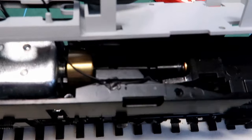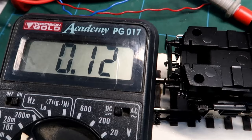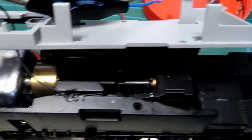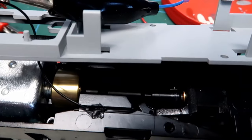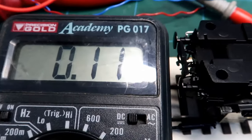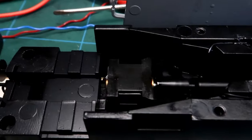So let's find out which side. With the right-side shaft assembled, it's gone up to 120 milliamps, but there's no problem with turning — I put a small screwdriver in and turned it through several revolutions with no problem. There's plenty of movement, so that shaft's not bad. With both assembled, we're back to 200 milliamps. That does suggest there's a problem on the other side. Shouldn't be that much — 100 milliamps just to connect the gear tower.